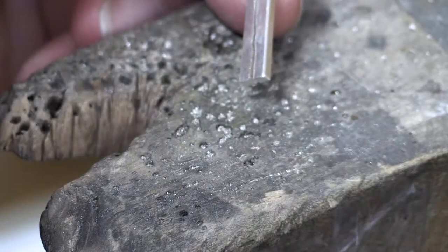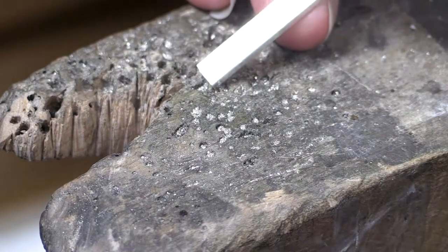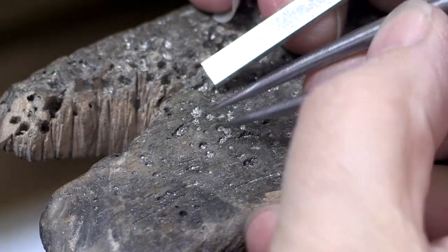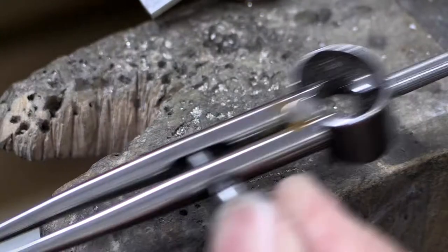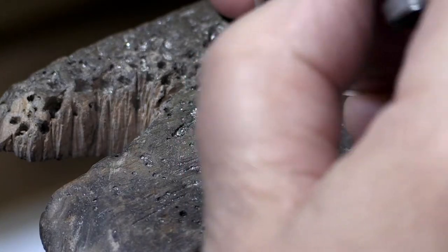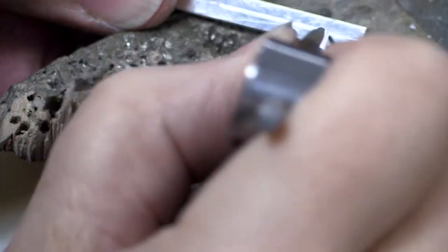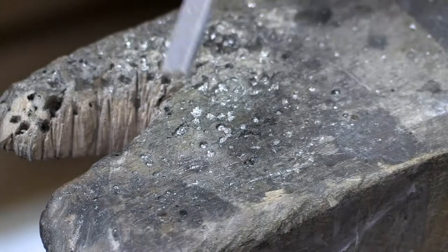I know I need to split this shank - I've split one end of it and I want to split the other end for you now. You want to mark a line down the middle of your material. I use a divider - these are a great tool, everybody needs a nice little divider. That way you can do this without having to use numbers. You just take your divider, find the middle and make a line. To make sure you're in the middle, flip it around and come from the other side - as long as you hit the mark in between those two lines, you're in the center.